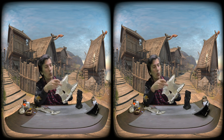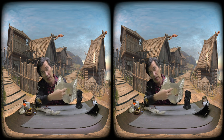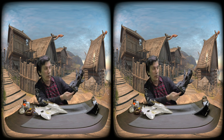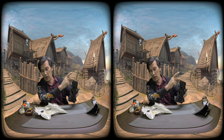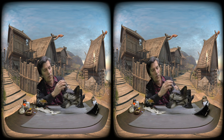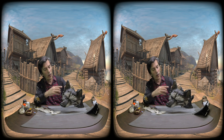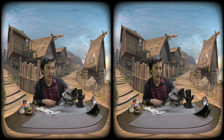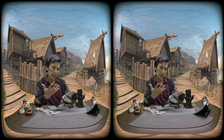It took about an hour. We have wire all along the perimeter here and in the eyes. For this one I got a little bit lazy — I got one around the bottom, one at the mouth, some at the arm branches, and one at the top. After we paint it with conductive paint, the copper is going to grow from where this copper wire is, outward, hopefully getting the most coverage in the least amount of time. Once it's completely covered, you just add more current and it plates up really well.